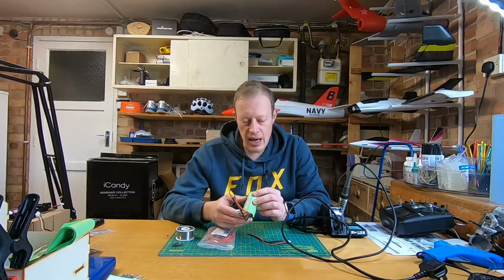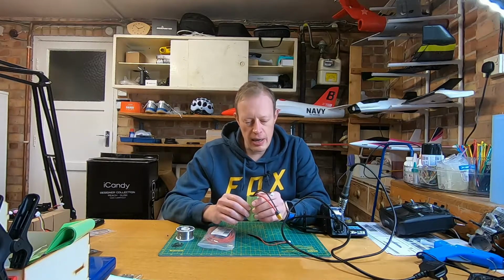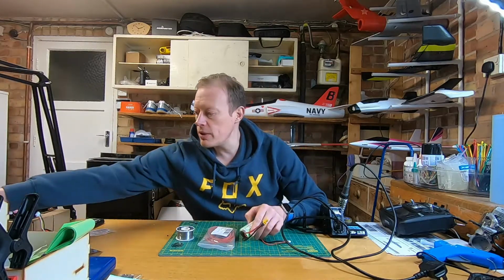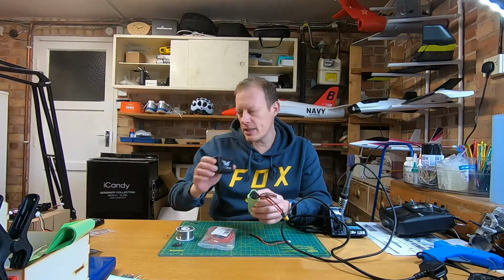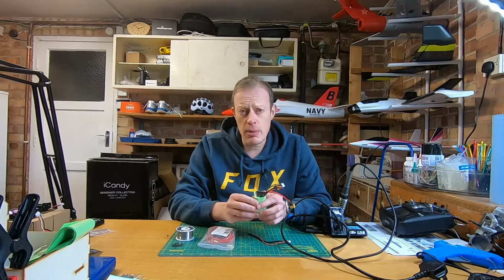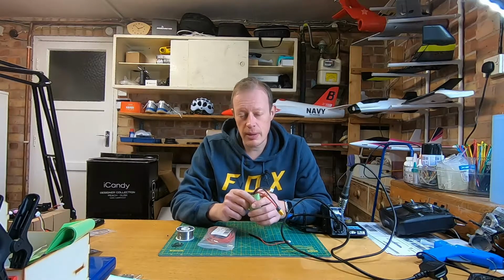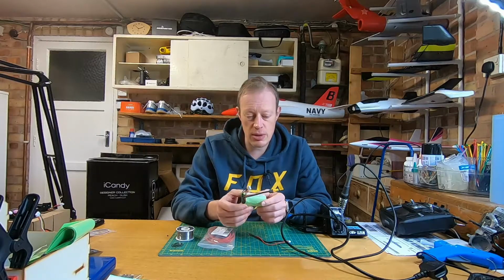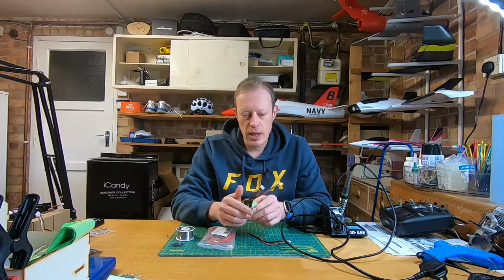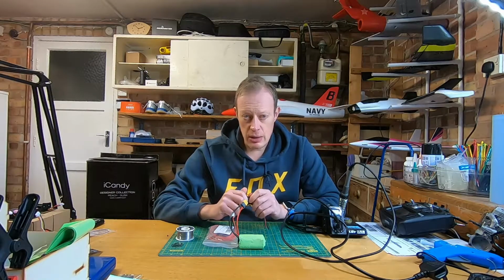And in fact, I have seen a chap on YouTube, I think his channel is called RC Jets or something, I can't quite remember, based out in Germany, who uses 21700 batteries, which I have got some of here. They're like 18650s, but a little bit bigger, and the ones he uses are rated up to 40 amps, but he's putting them in EDF jets as 6S packs, and he's drawing like 100 amps from them, and I've seen how he makes them. He's not doing anything special, so obviously you need to be careful, but when they're connected together, you can get a fairly high amp draw out of them, obviously just as a burst though, not continuous draw.